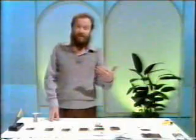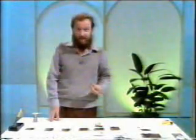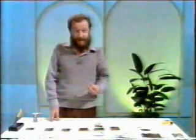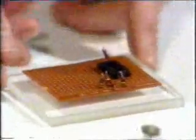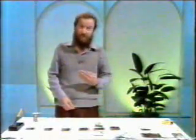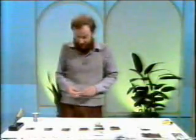Now, because the square is flashing on and off, if we check it too often, then we'll think one white square was 2. Alternatively, if we don't check it often enough, then we'll miss some of the flashes. So timing is crucial, and that's achieved in the circuit by means of resistors and a capacitor. Well, the next stage is to mount all 6 of the fixed value resistors, so either just 5, and then one variable resistor. The variable resistor is crucial because whether the square seems white or black to the receiver board will depend upon the brightness and contrast settings of your TV. So we'll have to adjust that later on to your own particular TV set.